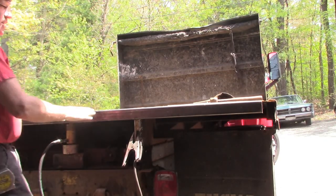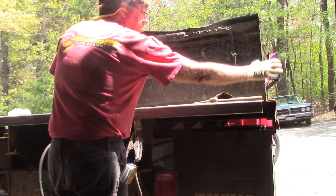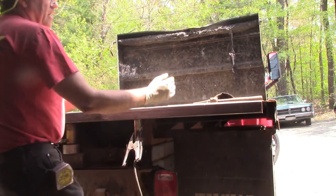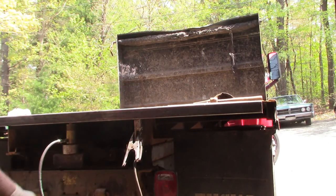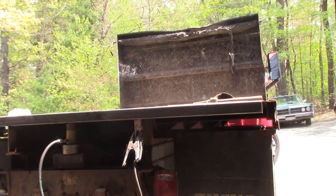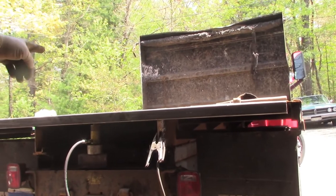Once this is in place and the bed is stitched in, now I can put the vertical posts in that come all the way down, pick up the wings off of this that'll go in next, and that'll give that vertical post some resistance to bending to be able to handle the weight of the hinges and the tailgates. A little more tweaking. We're almost ready to tack this in place.